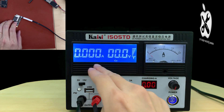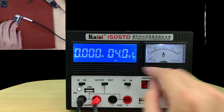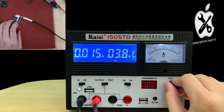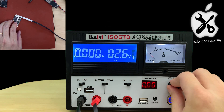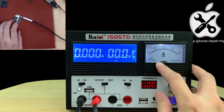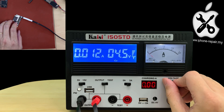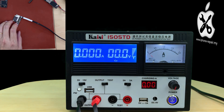So every time, if the power IC is working, it should react like this — even without the CPU. That's why sometimes it's really hard to see on the analog meter because the movement is too low. But on the digital display it is quite obvious.